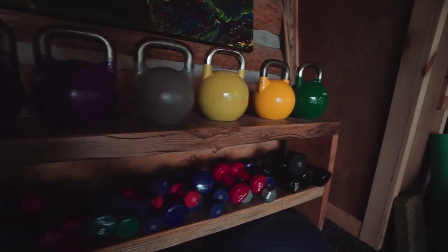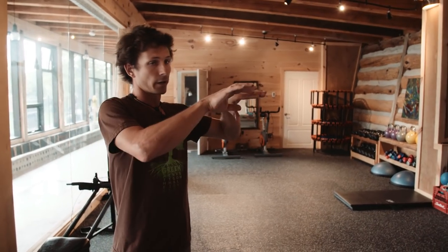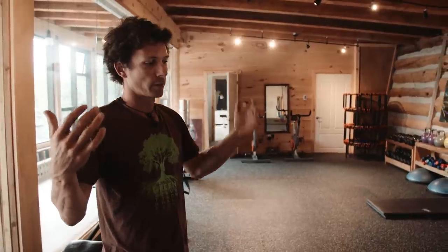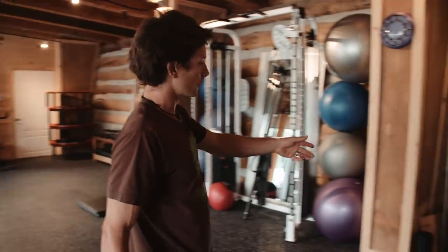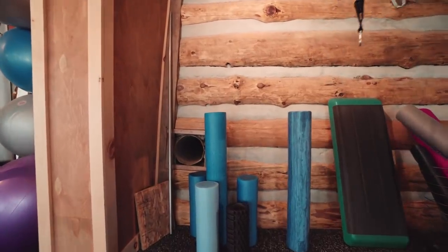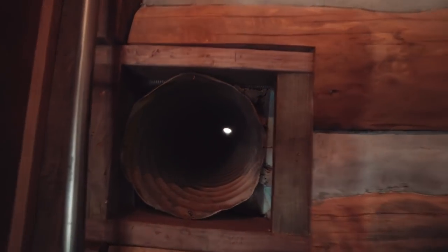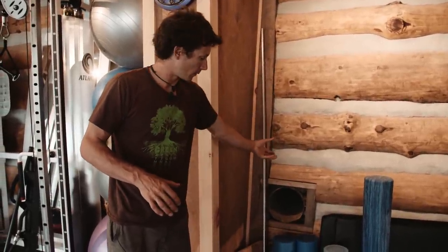What's great in here — she was concerned about the temperature — but even in the heat of the summer when you walk in right now it's cool already. Two-thirds of the Earthship is buried in Earth, so it passively works off of geothermal principles. We've got this cooling tube which is about 17 feet long going through the earth, and out the other end it's screened so that no animals can get in, but the air is traveling through those 17 feet of earth and cooling as it comes into the house.